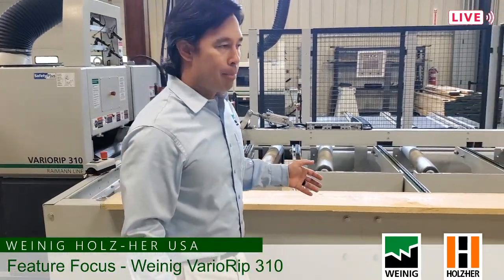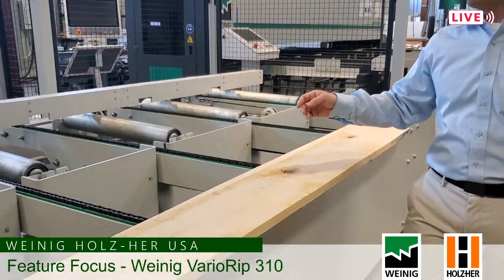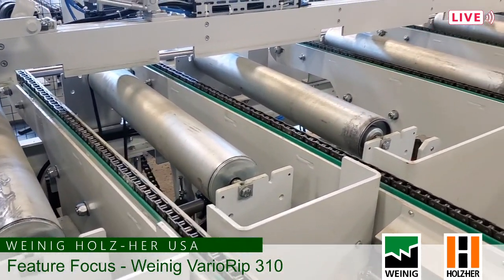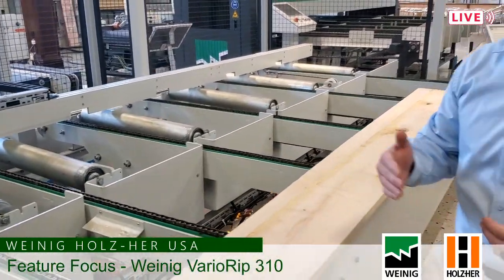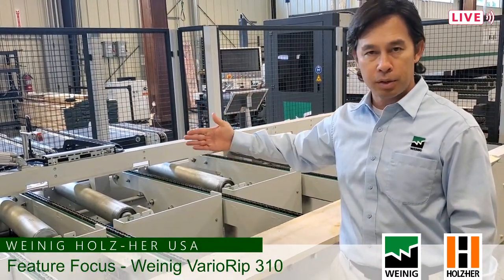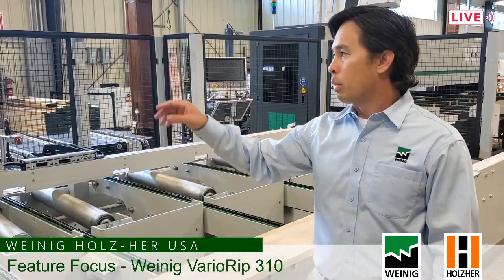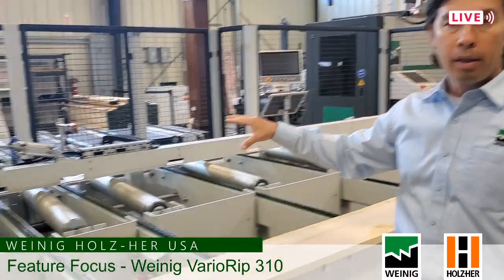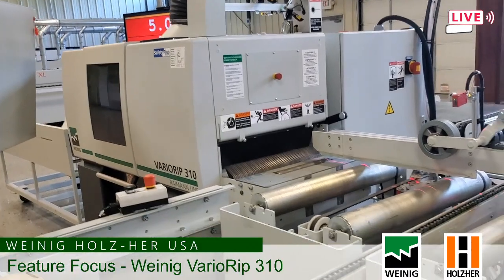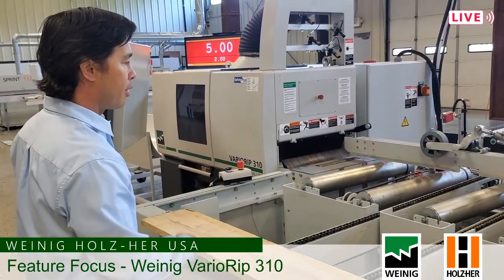On the compact we have 14 points of width measuring. All 14 points measure the width of the board at one-foot increments. Once we know all those widths we will know the shape of the board. The board gets measured, then it will send the board to the fence — a moving fence — and it will move into position to cut the sizes desired based on your cut list. We also have lasers on this machine, and the lasers show the operator what is going to be cut. As the fence moves into position and the blades move into position, the board will be sent through the saw and ripped to width.